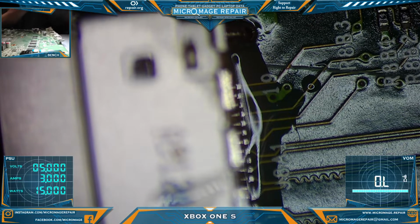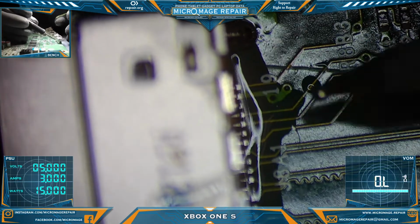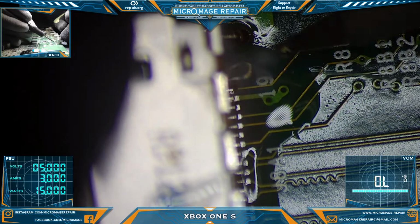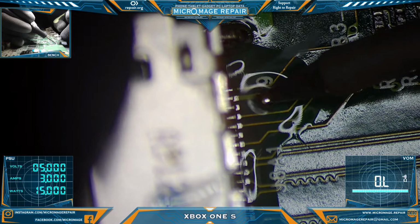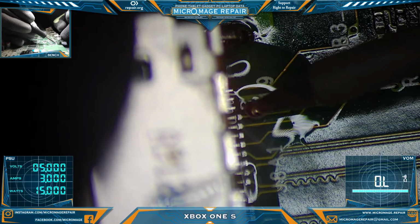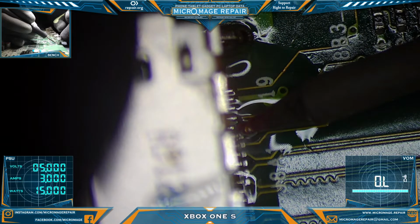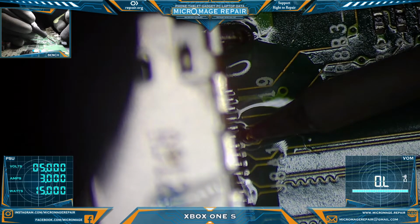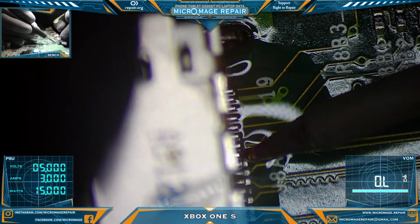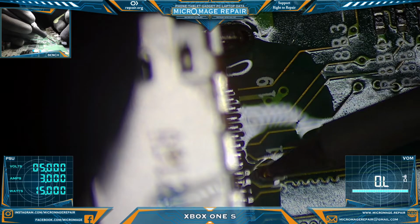Okay, get a bead of solder on here. Don't want it to be too big. Hey, I have it in view for once. Want to climb up the pin and give us a nice fillet. On the front, they don't have to climb all the way up the pin, but it makes for a nicer looking joint when it does.